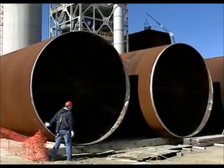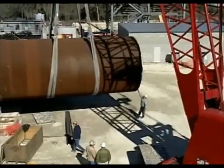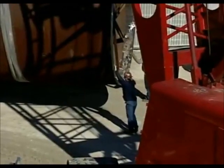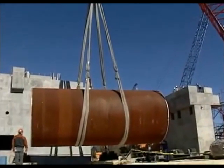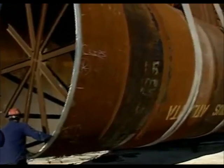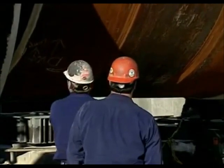While the base frames and roller placement work continues, the various sections of kiln shell are being pre-assembled on the ground. Shipping restrictions usually mean that a kiln shell is delivered in sections. To minimize the number of joints that must be completed in the air, the sections are put together in sub-assemblies on the ground.